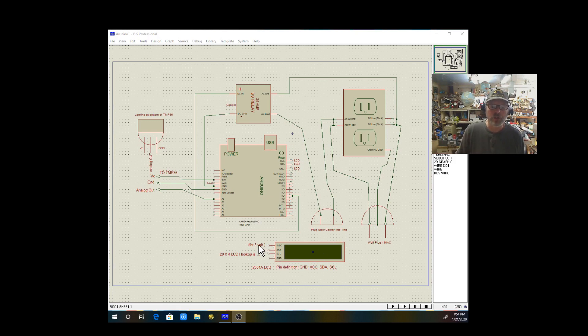I'm not showing all the hookup wires — it would be a rat's nest — but really you've got 5V in, SDA and SCL going to the back corner of the Arduino near the reset pin, and ground. That's the whole schematic — very low part count. I'm actually using an Arduino clone, which I've found to be very good. There are some weaknesses in serial communication, but I'm not using it for that here, so it was a perfect adaptation. Make sure everything is bolted down so it's not flopping around, because you do have line voltage in there.